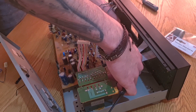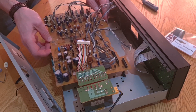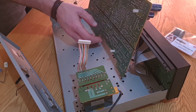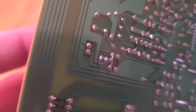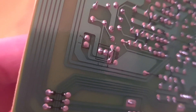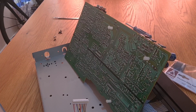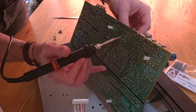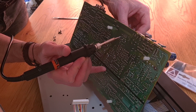This board is held in with some plastic clips - once you remove two screws you just nip them together and then lift the board up and out of the way. You don't need to unplug everything, you can angle it, but the power supply connector is the main one to unplug. Closer up, you can see that it's actually loose - there are dry solder connections on it. I've seen some where it's just completely ripped the contacts out of the board. I'll just reflow these two connections, which prevents any issues in the future, because this plug in particular does suffer from dry solder and it can affect your recordings.